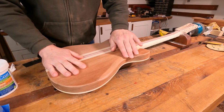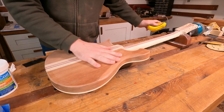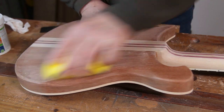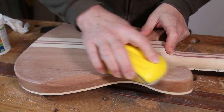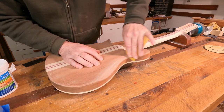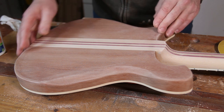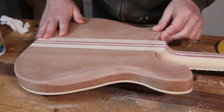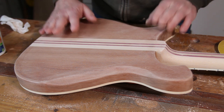I've actually left this overnight to dry — I got dragged into something else yesterday afternoon — so it's had a good long time to dry out now. It's dried out beautifully but it is a little bit rough to the feel, so we're just going to go over it again with a bit of 320. You don't need to do a lot — just take off that slightly rough feel. I'll get all the edges done, all the little roundos and everything, and then proceed to put another one or two coats of Aquacote on. Rub that all down, make it all beautiful, give the whole thing another check over to make sure it's exactly how we want it, and then we're going to be ready for spraying. However, I'm going to leave that till the next episode.